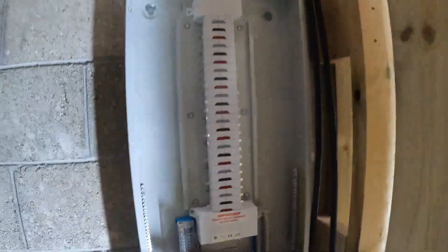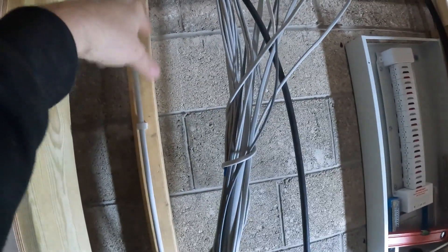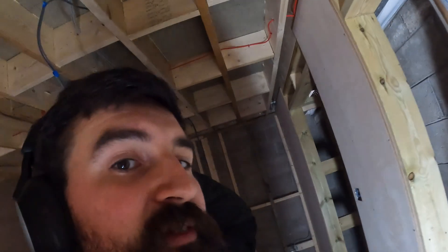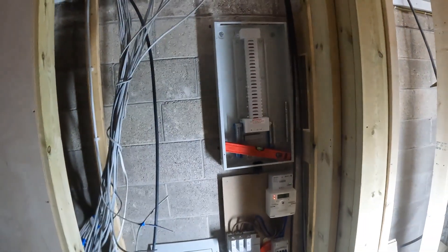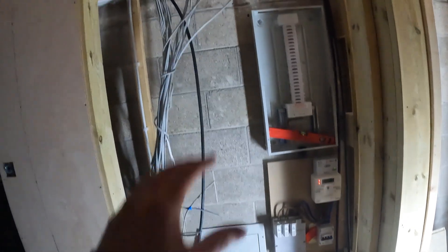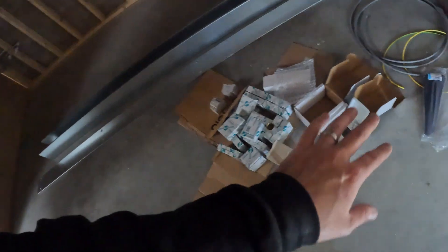The board is up - that's absolutely solid. What we're going to do now is get the trunking sorted. I said track lighting earlier - I didn't mean track, the customer's doing the tray. This is trunking. We'll get a measurement from here all the way to that wooden beam, maybe kick it back a few mil just so the end cap fits on, same again for this side, mark it out, and get that angle ground. A lot of this is in the planning - like what breakers are going where, where you're going to put your contactors for your shop lighting, where you're going to put your SPD. On this top bit we'll have to fit a box for SPD and a box for the contactors. We've also got isolators for like heaters and stuff, and key switches.